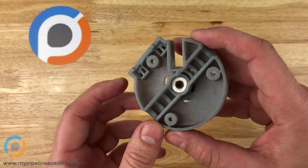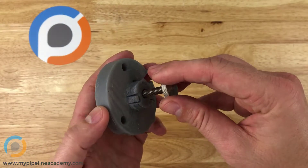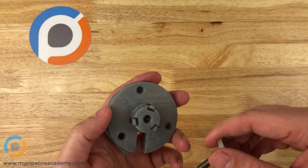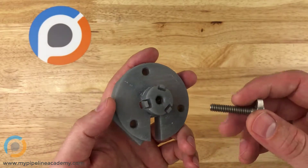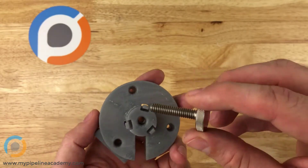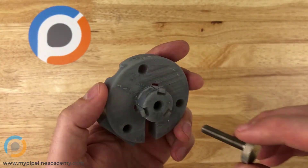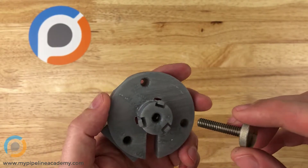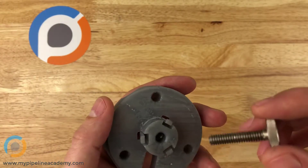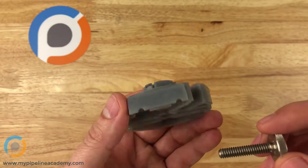This is a 3D printed plastic part and we needed to get this thumb screw installed in this hole. We could have tapped that hole directly. Tapping, by the way, is the process by which threads are created in a hole. So we could have directly tapped the material and it would have created geometrically correct threads in which you could screw this thumb screw into. But if we were to apply any real load — trying to pull that screw out or push it in — those threads would pretty quickly start to degrade or wear away, especially as we started screwing it in and back out.